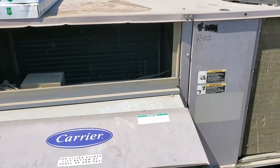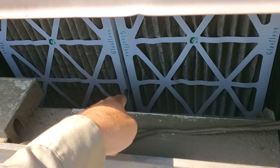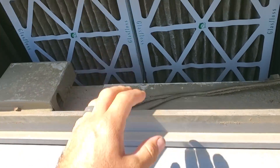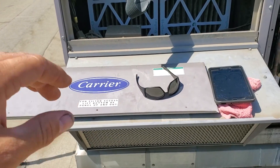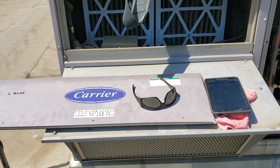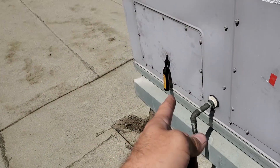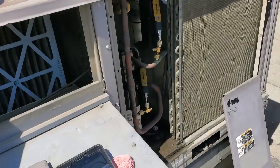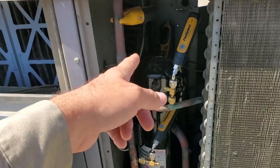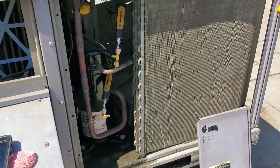We are all defrosted. We're going to go ahead and start this guy up. I have a return air sensor down in here — it's just stuck where it's getting a little bit of mixed air because this economizer is broken, the damper, and someone has it jammed open. The discharge air — I'm not going to be able to get down in the ductwork, so I have to do it at the discharge spot right there. And then obviously discharge pressure, suction temperature, liquid temperature — all that good stuff. We're going to start it up and see what happens.